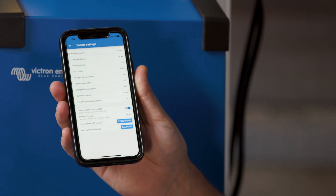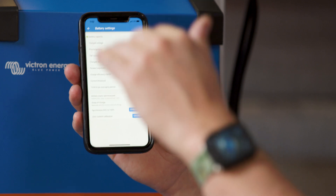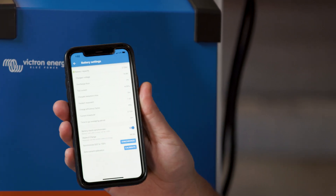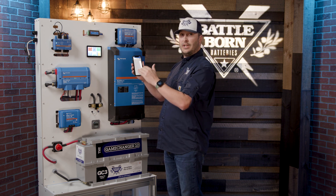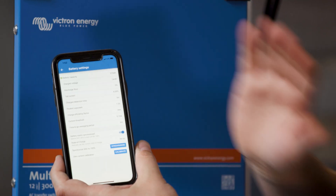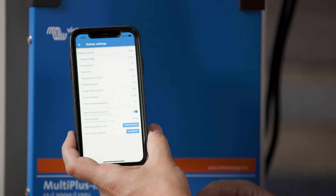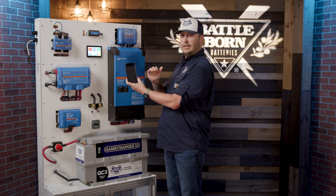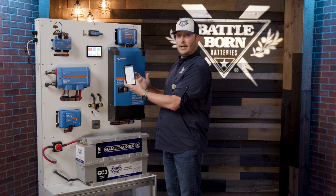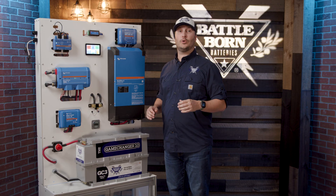Now, here's where people do things differently. Personally, I like to have battery start synchronized turned on. That means when we get over the 14.2-volt threshold, the battery monitor and system all sync up. Every time you bring it to a full state of charge, you get a true accurate reading. With it set that way, you don't really have to play with it. The other options below let you calibrate and synchronize state of charge manually — but personally I'd leave those alone unless you're 100% sure your battery is at a full state of charge.